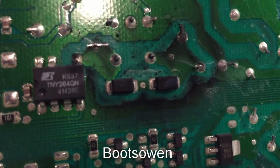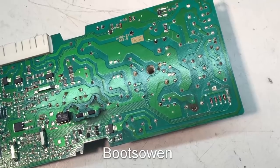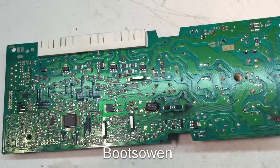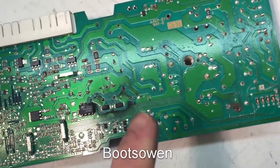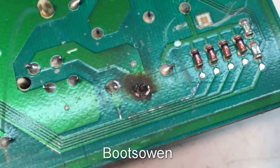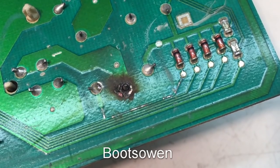Just a cursory glance shows that there's a bit of action on that circuit board. In the world of fixing stuff, if something's obviously wrong, it's normally that that's caused the problem. There could be more than one thing, but start with the thing that looks broke. Over here it looks dirty, and over here you can see that that pin has blown clean through the solder around it.